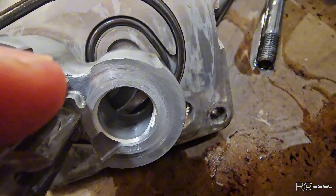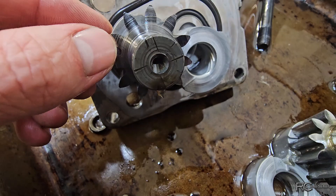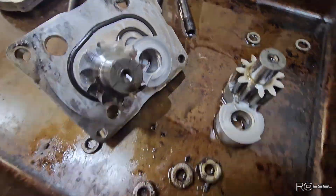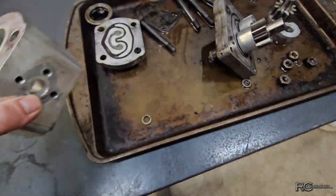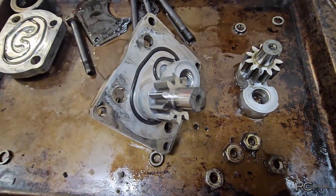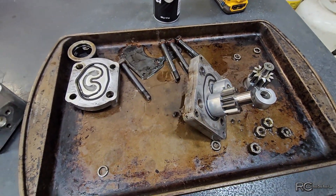This sealing cushion block needs to be replaced, and this one too — this one's really worn into there as well. The gears are scored a little bit too on these ends. That's your seal right there — what seals the hydraulic oil is just a very tight clearance, and once these get worn and pitted like that all your oil just bypasses. You can see the step down in the bottom — the center housing needs to be replaced, the gears need to be replaced, and the top and end bearings need to be replaced. We're getting into some pretty expensive pieces, so we'll have to check the price of a new pump because rebuilding this is probably not going to be worth it.